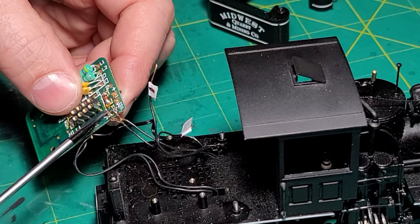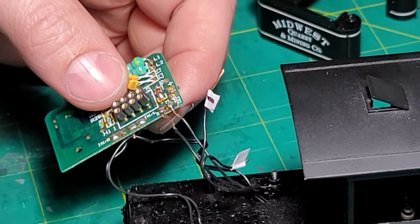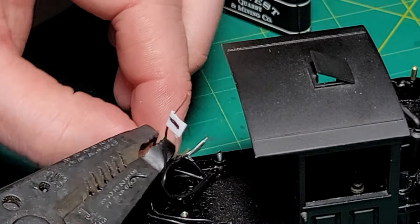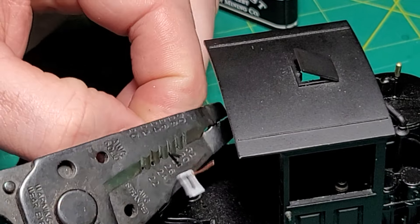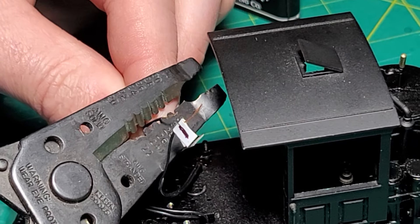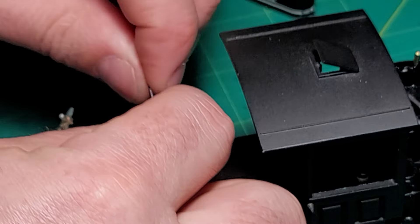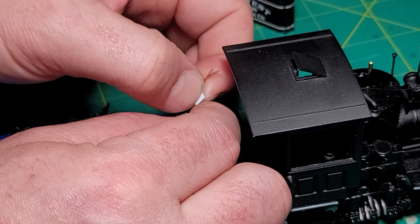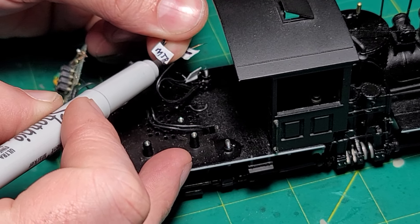Working our way around, this is motor one and motor two. There is a plus right there, so this one technically is probably the plus, but like I said, for our needs it doesn't matter which is which. So you cut both of these and tape them together. Strip both wires, tape the two leads together, and call this 'MTR' — M-T-R — so you know that's the motor.